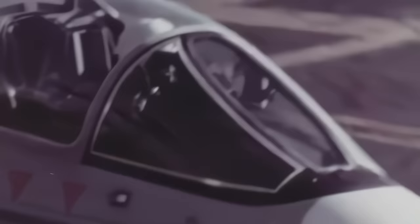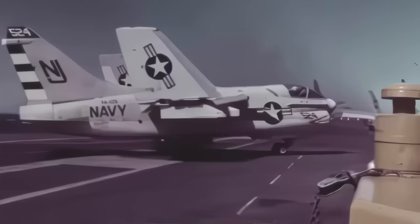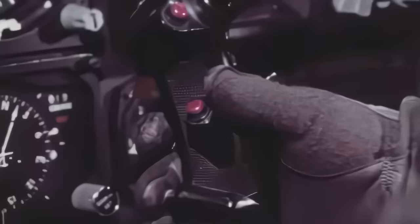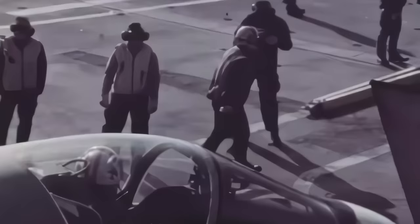Usually, a maximum of 70% will be enough to counteract the effects of jet blast or high wind as you taxi to the catapult. Follow the director's signals at all times. If you're waiting behind the blast deflector for launch, hold the nose steering button engaged, brakes on. This will prevent the aircraft from swinging around or sliding due to wind or jet blast.